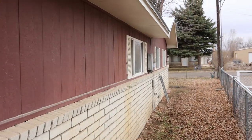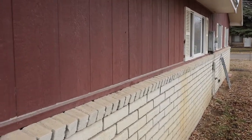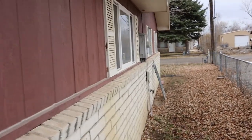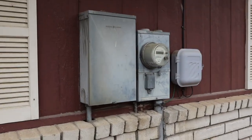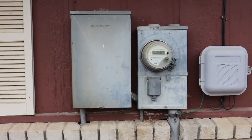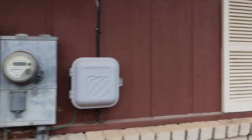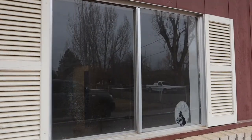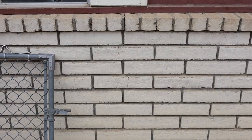That's the back of the house. Here's the other side — sorry for the weird angle, it's hard to get in here to see it very well. We're probably going to have to upgrade our electrical service. We want to add an AC unit to this house and this electrical service is only 100 amps, so we're going to have to upgrade that. And of course you've got some of these aluminum windows — we'll get rid of those, repaint this siding on this side, and hopefully dye this slump block a different color.